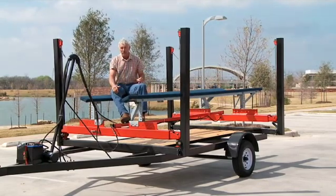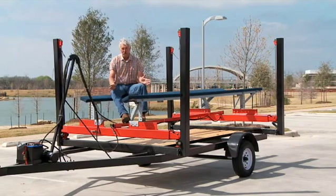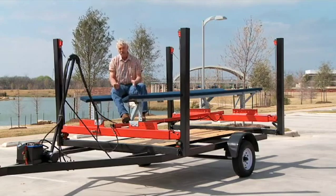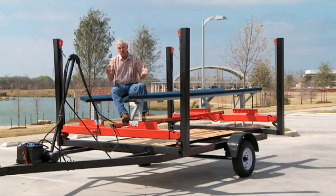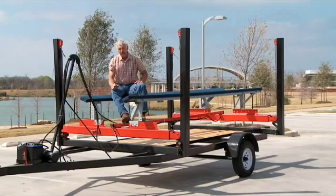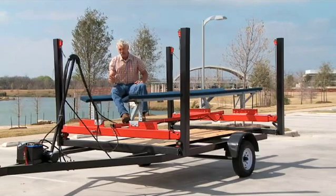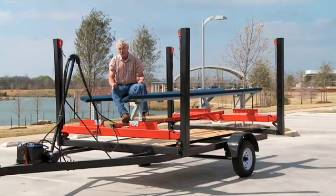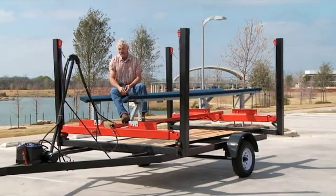Some of the key features of this lift that are truly unique are the flexibility of the beams. The beams are expandable from 10 foot to 12 foot, and then the next level will probably be 12 to 16 foot for the larger boats. Each beam has a capacity of about 4,000 to 5,000 pounds. If you have a 20,000 pound boat, for example, you would use four common standard beams. That is totally unique.